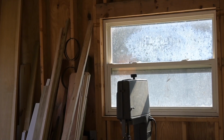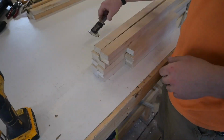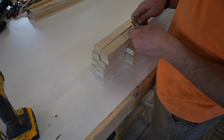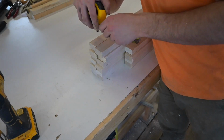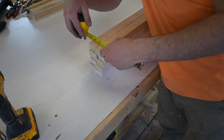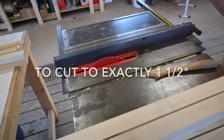The main pieces are exactly 30 inches long. We're gonna begin laying it out. 3/4 of an inch. I know you're not supposed to scribe with calipers and supposedly machinists will writhe in pain when you do it, but it can't be that bad. And we have no vacuum because the vacuum died, so I'm gonna put on a mask. Though, really, we have a door open over there, and we also have two giant doors open over there, so it's probably not gonna be that much dust, really.